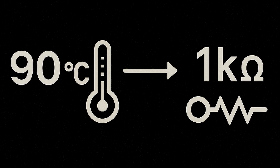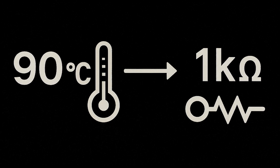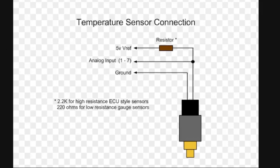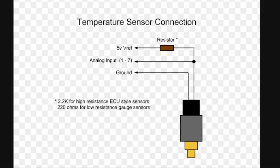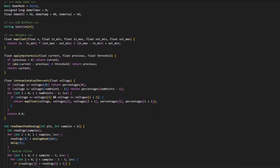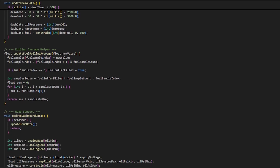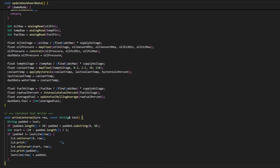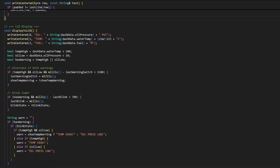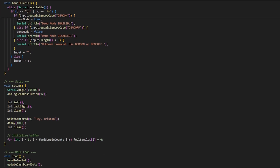That doesn't mean we can't use triple-wire digital sensors as well with the ESP32 — something that takes a five-volt reference, a ground, and an input. In fact, I'm actually doing that already. But if you connect all that up and give it a bit of code — I'll leave a link to this in the description because you may want to edit it yourself or just take a look — at the end of the day, all it's doing is taking a voltage divider signal and putting it onto the screen of the ESP32.